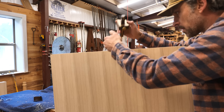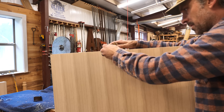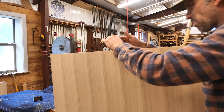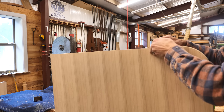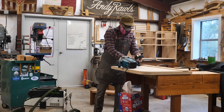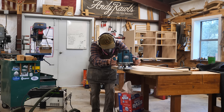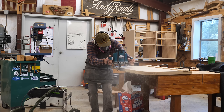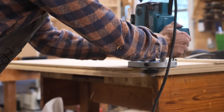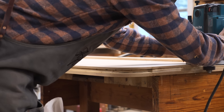With those done, I've got the two mating panels that capture the brass and make one big panel. I need to cut a slot down the middle, so I'm marking it out with my marking gauge set to the thickness of the laid-up brass, and centering it on this panel — which is an inch and a half, being two pieces of three-quarter glued together. I'll run the router down to that knife line and dial in the groove to be perfectly centered. I put banding on the outside of this plywood, but had some issues with it popping off, so I did a lot of climb cutting to save it from chipping. For the most part it came out looking pretty good.